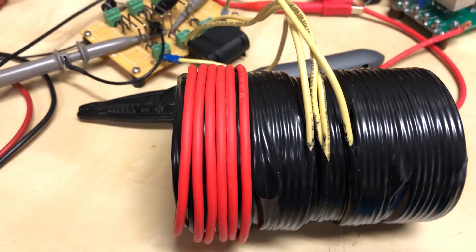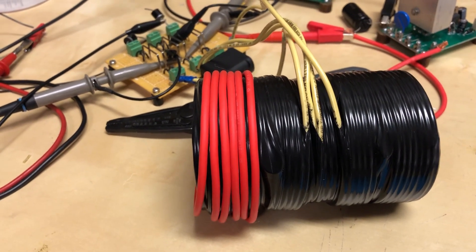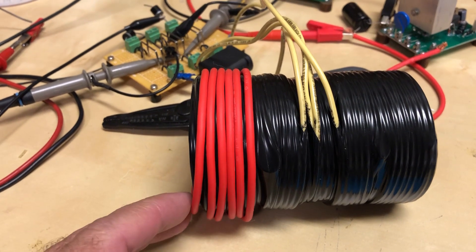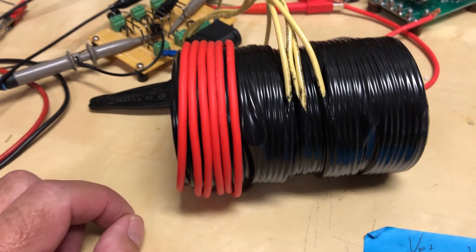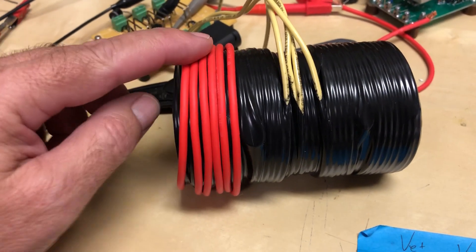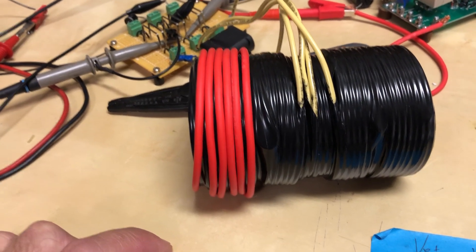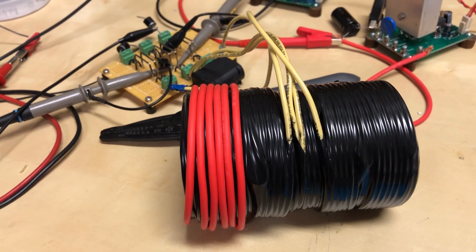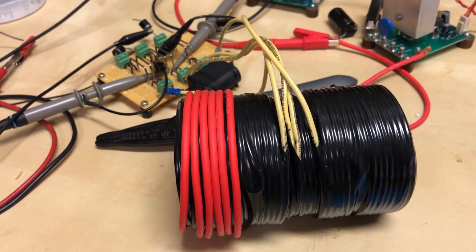So I've got about 125 milliwatts of power pumping between these two coils. There are a few other things I want to try — I'm just not getting the magnetic coupling or the current high enough. I know I need to go look at that online calculator again for guidance. Just wanted to give an update — I'm working on this and it's pretty exciting to finally start having some of these concepts come together.